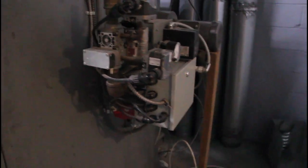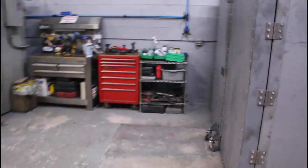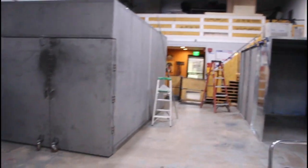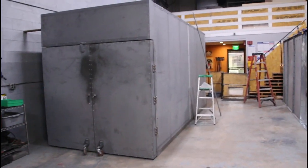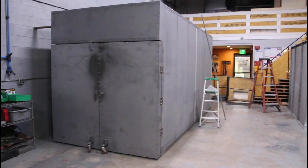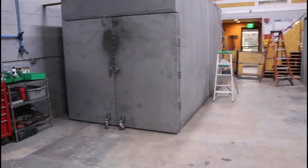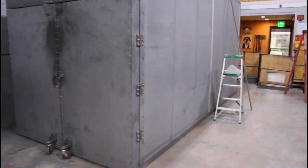Because in order to run it, we need to either upgrade our supply line, which is up there, to a 2.5 inch in diameter pipe. So basically, in order to do that, we have to get a permit, get a new meter outside, and then run a whole new line into the building. So as you can imagine, it's costly, it's annoying to deal with the town.